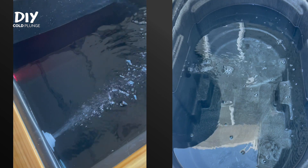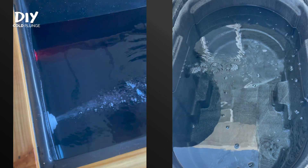In most cases, this is a plumbing setup issue, not an ozone generator issue. With everything functioning correctly, you should see bubbles coming at the inlet or return at your tank whether your ozone generator is connected to the Venturi or not. Over time, you'll also learn to sense the smell of ozone. If you don't see those bubbles, you have a plumbing issue that needs to be addressed.